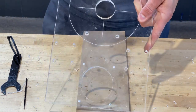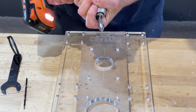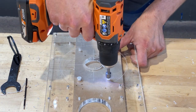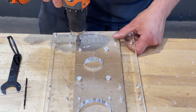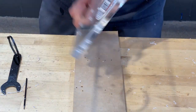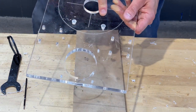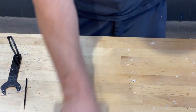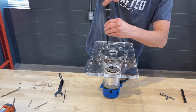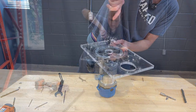I've got the back side up now — you can see the Crafted Elements logo is mirrored. I'm going to use a countersink bit. One piece of advice: do the minimal amount first — you can always go deeper but you can't put material back. Once done, you can see the screws are nicely countersunk and protrude enough to grab the router. I'll bring the router back, line up the holes, get the screws in, and that's it.